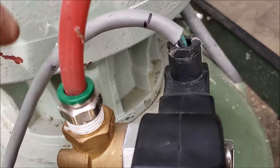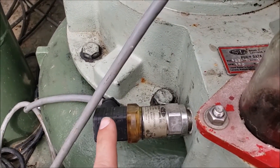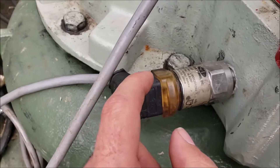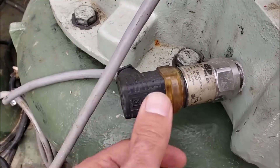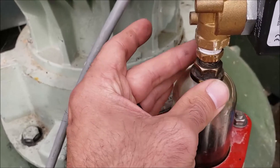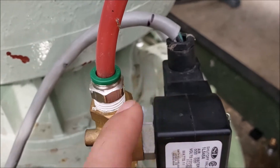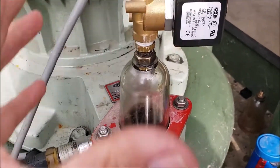At your solenoid, you can see this one is a little bad — I wasn't able to fix it. If these rag up and vibrate, I've had connections come loose. By connections I don't mean just the screw — make sure the screw didn't back out and lose connection — but actually on the inside of this fitting where the wires terminate into the different terminals, I had a wire that vibrated loose, causing this not to get proper power and never sense prime. You'd see water primed all the way up to this point but it wasn't kicking in. Same on the solenoid — I had a wire come loose on the inside of that connection, causing this to never actually open, so from here it was pulling vacuum but not opening.